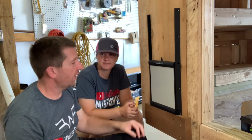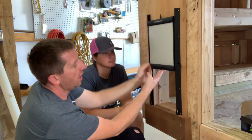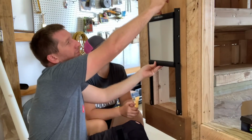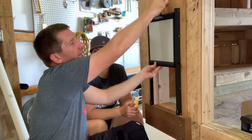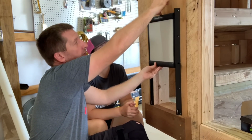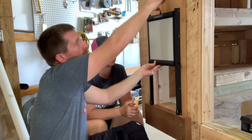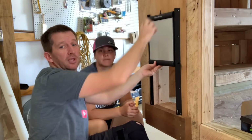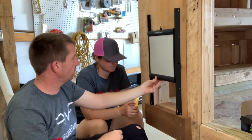One other thing that we noted, or that we did read in the directions, is whenever this door is up, you want to have about 4 inches between the bottom of the closing mechanism and the string. So you want about 4 inches of space right here. And so when we program it, we want it to raise up to this point. So we left a 4-inch gap and then enough room up here to install the closing mechanism. So let's go ahead and get that installed.